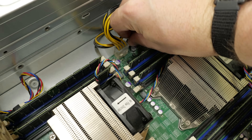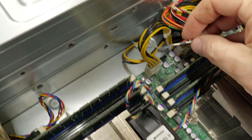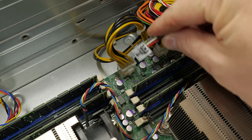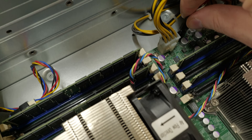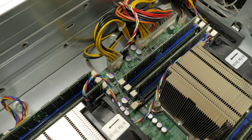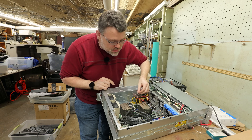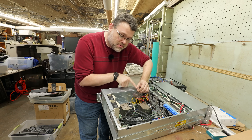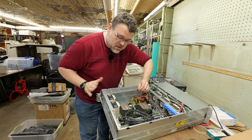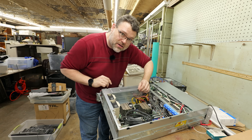Check out the power supply connector I mentioned at the beginning. There's a system management bus header — it's a glorified low-speed, low-wire-count communication interface. But for this particular chassis, the power supply can actually communicate with the ASRock motherboard through this interface. That's not always going to be the case, but here it actually is true. You can plug this into that black header at the top edge of the motherboard and be notified at the out-of-band management level when one of the power supplies fails.